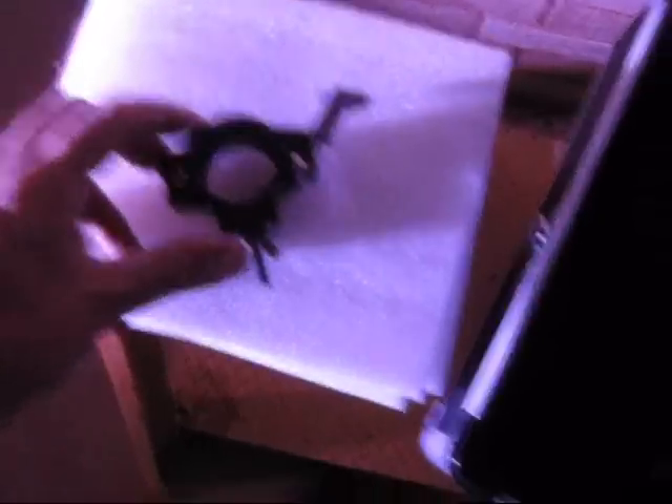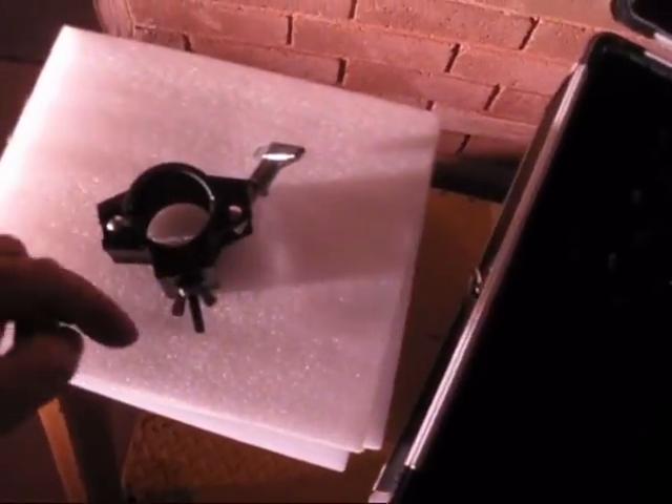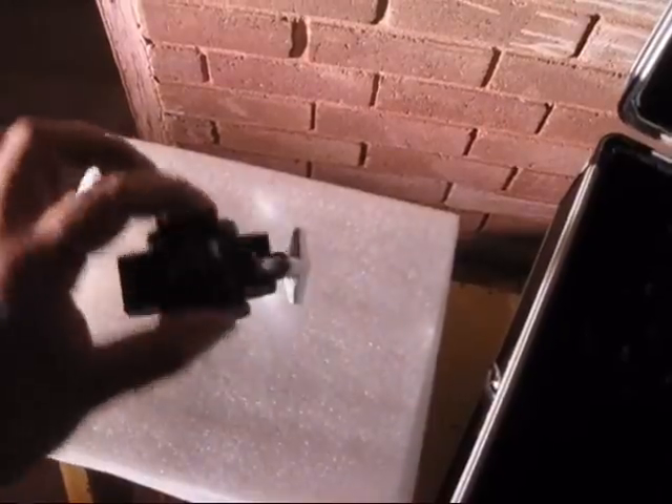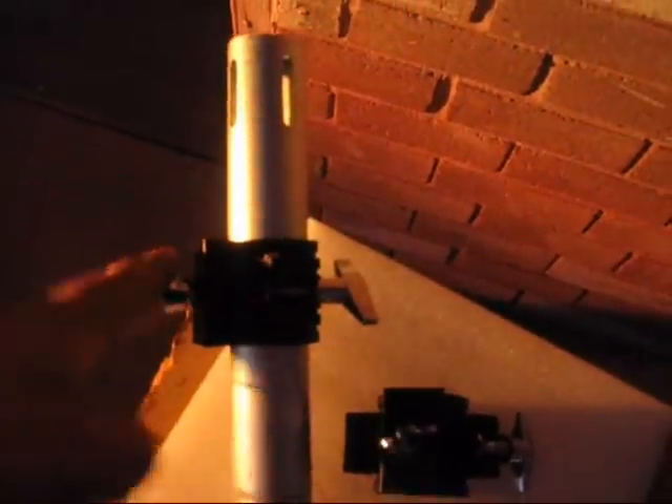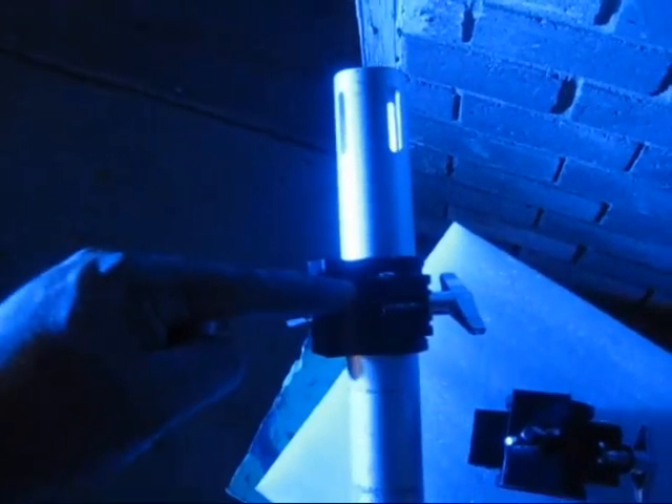O clamps don't do that. Plus, I think they have a much stronger connection because it goes all the way around. It has the ability to fight forces in this direction. When you hang anything off of a pipe, the torque you're receiving is in this fashion — everything is hanging out this way and the weight is hanging down. If it was a C clamp, all that torque would be on the bolt itself and really digging into the pipe. So if you were using a thin wall tube like this, it could seriously damage the pipe.